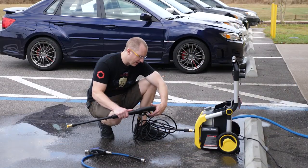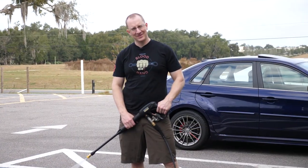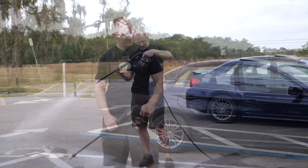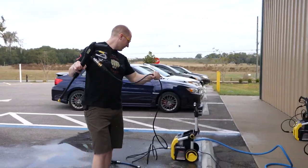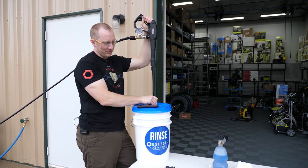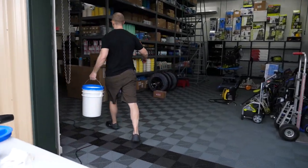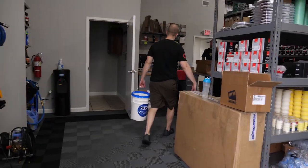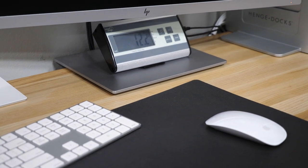It really takes a lot of effort to get the air out of here. I sat there and ran the air out for three minutes. Okay, we're finally up and running — we're at 1650 PSI. Interesting that the 1800 PSI model gives us less pressure. This gun is rated at 1.5 GPM maximum. How much current are we drawing? 14.3 amps — so we're drawing an amp less than the 1700. And the flow result is 1.14 GPM.